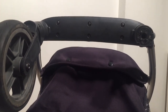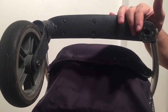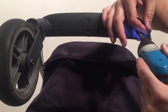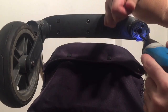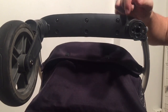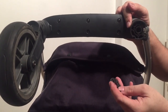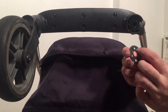So if you have those tags worn down, or you found that the lubrication advised in the previous video did not help, here's one thing you can try. Unscrew this plate here, and then you can take it out just on the side right where the swivel locking mechanism is — just pull down and you can pull it out. You'll see that there's a little depression above each of those three tags.